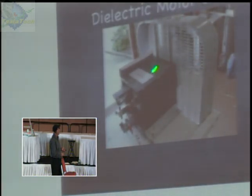So here's the motor. Here's some details on the magnet. First of all, I used 5/8 steel axle, simply because it would fit inside of an extrusion that you can find in hardware stores. The extrusion has a 3/4 inch outside dimension. So these 3/4 by 3/4 by 3/4 neodymium magnets fit snugly in there. And then I put a 1 inch by 2 inch by 2 inch neodymium magnet on each side. And that's about a 4-pound magnet.